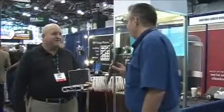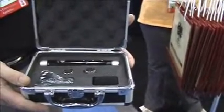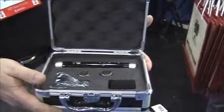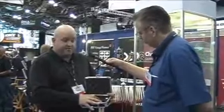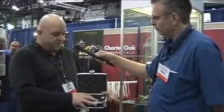There's also a small membrane microphone. That's right. We make a 20 millimeter capsule model, the M900, which is shipped with all three capsules: cardioid, hypercardioid, and omni. This is the M900. It's the newest of the models we've released — a small diaphragm condenser. The mic is fitted with a 10 and 20 dB attenuation switch and a two-position roll off at 75 hertz and 100 hertz. This is an all-purpose microphone — a very robust sounding microphone for a small diaphragm. Most small diaphragm microphones are engineered to be perfectly flat, but this one we gave a really distinctive EQ, which is really well suited for recording music.